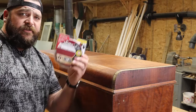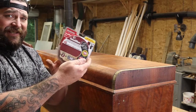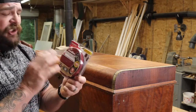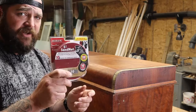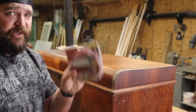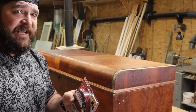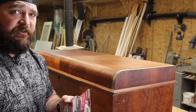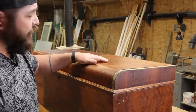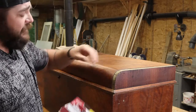Next I'm going to use some Diablo brand sand net sandpaper on my orbital sander — this is 220. This stuff is really good because it doesn't clog up and you get a lot more use out of one sheet than conventional sandpaper. I've come to find that anything with the Diablo brand name is really good, especially their thick metal sawzall blades. I'm going to use this 220 to start going over the lid and smooth out some of these rough areas and see if it gums up.